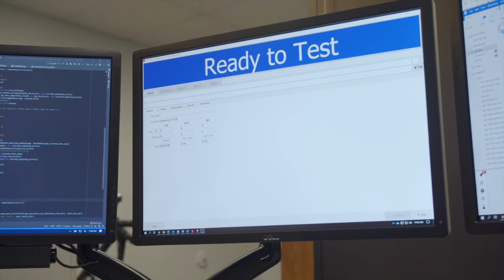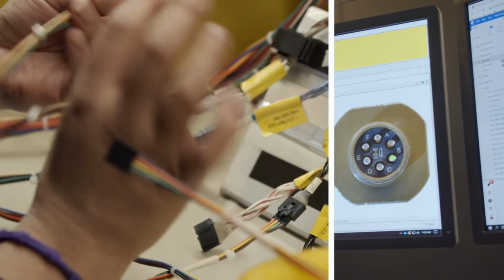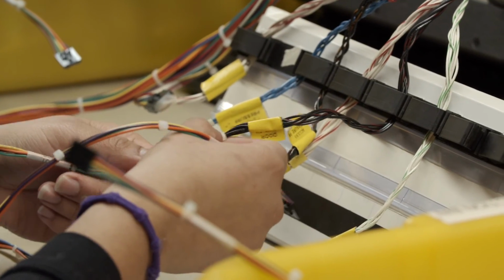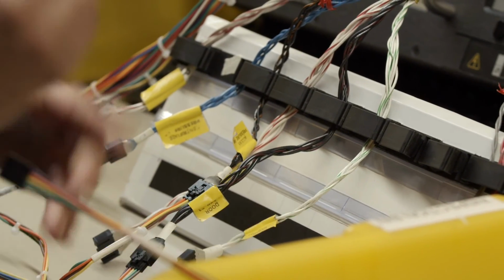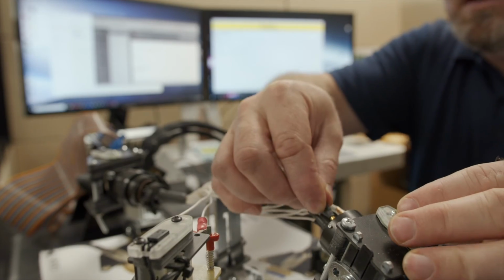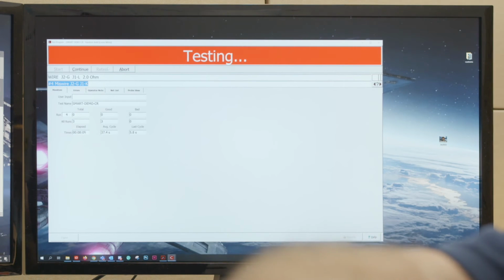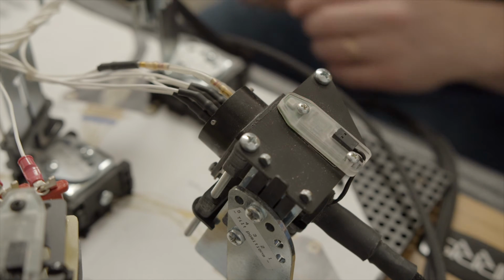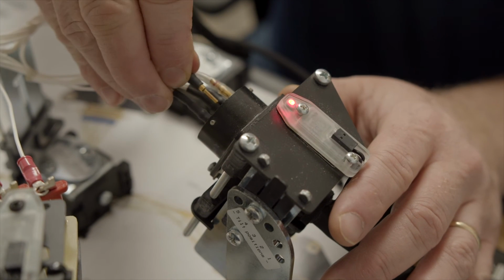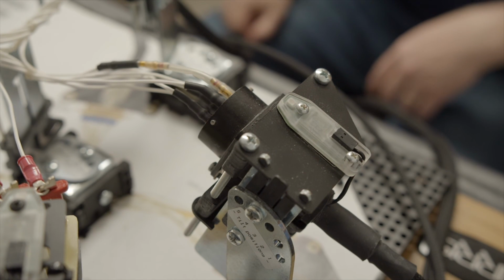Control the 8100 using the powerful Cirris EasyWire software. EasyWire's continuous test feature can be useful during assembly, rework, or troubleshooting. Audible feedback can alert operators of potential errors before they occur. EasyWire provides graphical instructions on the screen and LED prompts on the harness board. This technique guarantees the cable is wired according to the specifications.